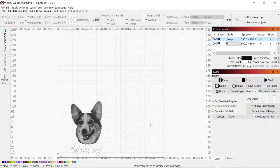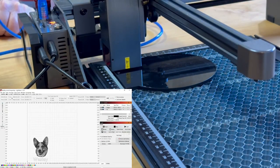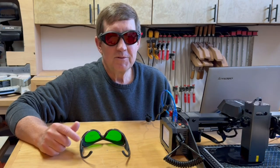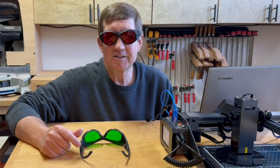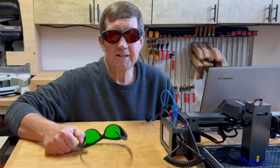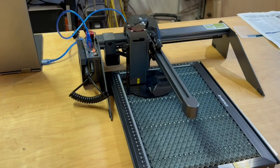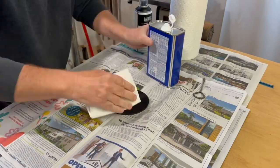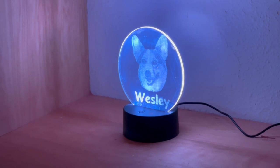I've imported the image into Lightburn and configured it to be engraved using the dithering feature. I push the start button to kick off the laser. The shroud does a pretty good job of protecting your eyes, but when engraving clear acrylic the blue light flashes everywhere, so I put on safety glasses — in fact I wear them anytime I use this laser. You can get either amber or green colored ones; both work with this 450nm laser. The amber ones have a slightly higher optical density so they're probably a bit better, just a little more difficult to see through. This looks like it came out really nice — I just need to remove the black paint with some solvent; I'm using lacquer thinner, but alcohol would probably also work fine. The result is a really nice looking LED nightlight.